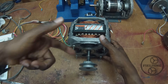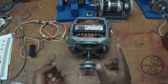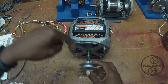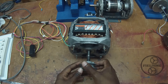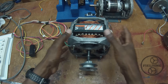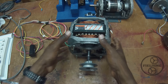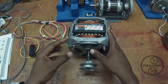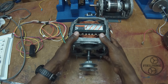If you think about it for a moment this makes sense. We have a magnetic field that's pulsating top and bottom. We give the rotor some momentum in one direction so now it's rotating, and the magnetic field is pulsing and hitting the rotor as it goes by. That pulsing magnetic field was enough to sort of simulate the rotating magnetic field that we had before. The torque that's produced by a single phase motor is not nearly as smooth as that of a three phase motor — in fact it's pulsating just like the magnetic field, which replicates how often there's a nudge or force pushing on the shaft.